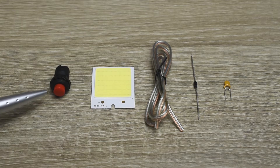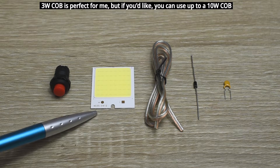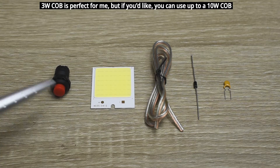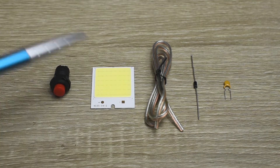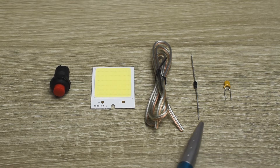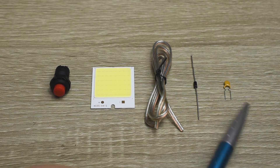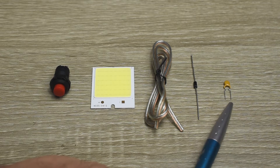You're going to need a push-on/push-off switch, the 12-volt COB LED panel like you see here or a similar one — I'll place a link in the video description to make it easier to find these parts. You're also going to need a foot or two of two-conductor hookup wire (20 gauge is more than enough), a 1N4001 rectifier diode, and a fuse rated up to 1 amp. Or, even better than a fuse, I'm going to be using a PPTC, known as a resettable fuse.